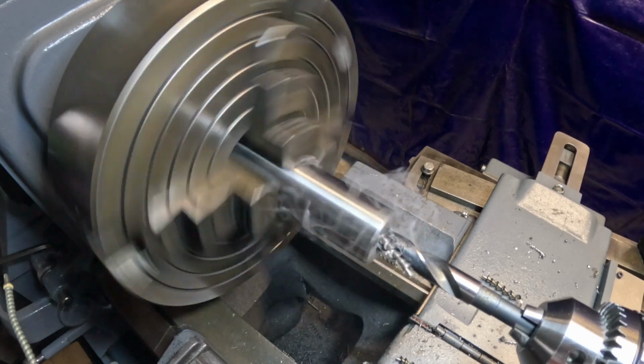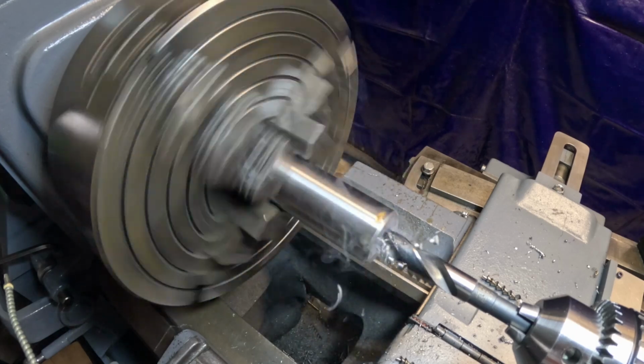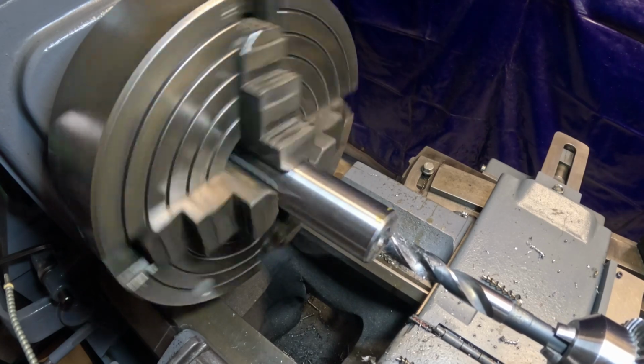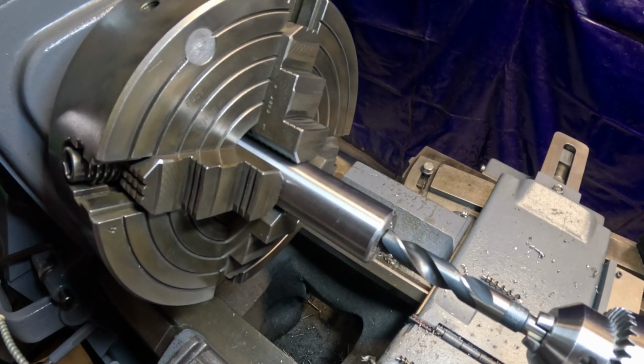All right, there's my 3/4. And there's 7/8. Okay. I'm going to swap this out to just under a 3/4 inch bit. I'll go check on that. I should have looked for one already. Let's just pause this for a minute. All right, now I've got a 21/32 there. I'm going to run that down into 7/8 down in there, and then we'll try end milling it out. Just see my other adapter.